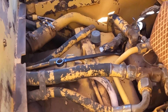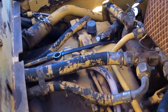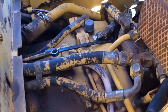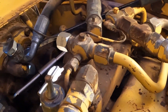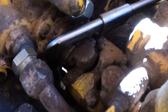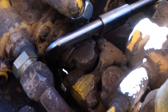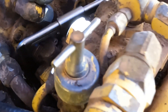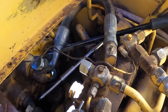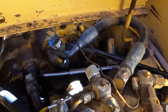If you look back here, you'll notice there are two different versions of this transmission. This one is what's considered the large transmission — it's the older one and it's a little bit harder to deal with. The reason for the smaller transmission on the newer ones is that these two U-joints are really close together. You can't pull that U-joint out without pushing the engine bell housing and torque converter forward on these older ones, whereas the newer ones with the small transmission have a longer gap between the transmission and the torque converter, so you can actually take them out separately.